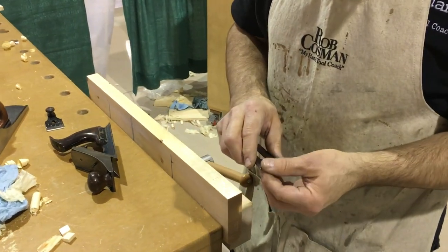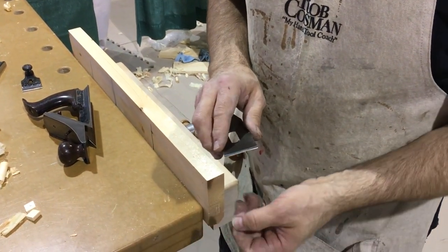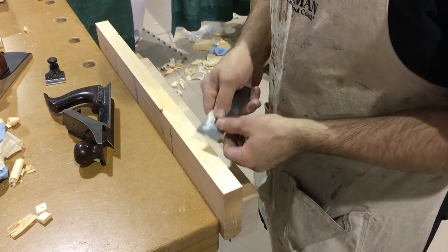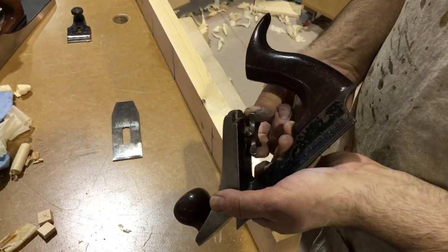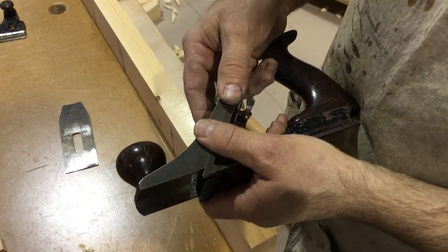Sometimes on that softer steel it's going to leave a little bit of a burr still, even after doing the ruler trick. So I just use the base of my palm to rub it back and forth. Or if you don't want to do that, you can do it on a piece of wood. I don't feel anything there, and it feels like a pretty good edge. What I really like about this plane is — look at that adjustment knob. It's so easy to get lots of torque on that. I wish the adjustment knobs on planes today were like that.